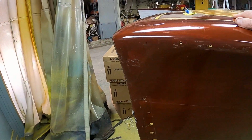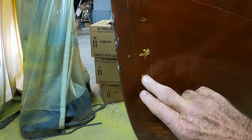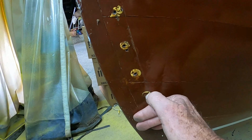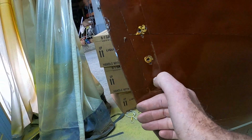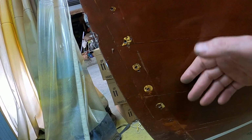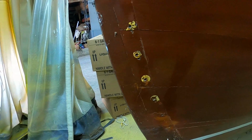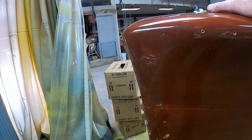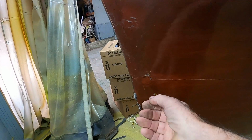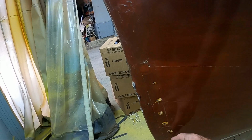Similarly, you can see, I'm not exactly sure what's going on here. Looks like somebody tried to fill these holes with, I don't know, that's not just in the surface. Oh, maybe it is. Yeah, somebody tried to waterproof. This isn't doing anything other than forcing the cutwater away from the wood. That's not your goal. Your goal is to keep water from penetrating there. We just use a sealing compound, Dolphinite. We dip each screw in and drive it home, spin it home, and the Dolphinite fills that void and provides the seal that you want.